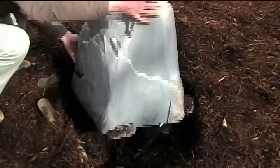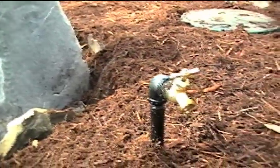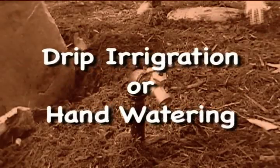We use a pump station to pull that water out, and the pump is constantly under pressure so whenever the valve or the faucet is turned on, the homeowner will have 8 to 10 gallons of water a minute for irrigation with drip tubing or hand watering.